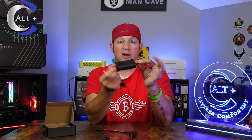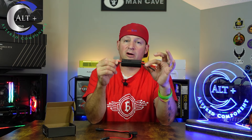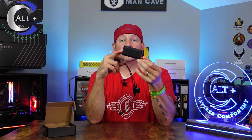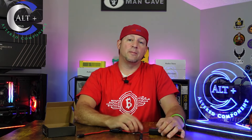Let's open this up, see what it looks like inside, and see how the wires are hooked in. If they're just soldered in and it's an easy solder, we'll probably just cut these ends, run them into the plastic housing, and solder directly into the board. If it looks like a pain or uses high-temp solder, we'll just use connectors and crimp the ends on. Let's go ahead and open that up.